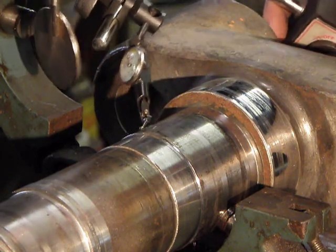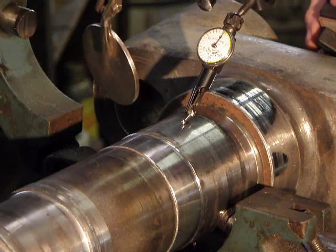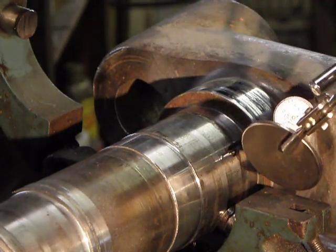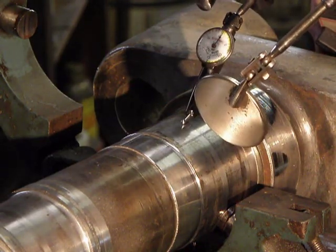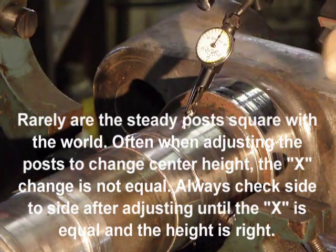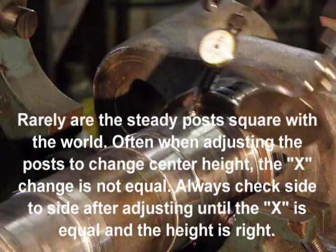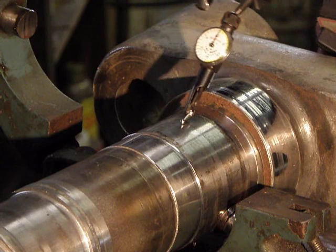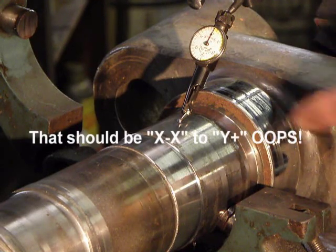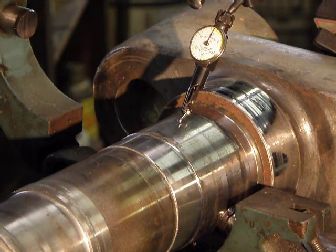About plus one at the top. Minus one. Minus one. Plus one. Minus one. That one's got to drop just a little bit on the back side. See what this looks like — that should be it. Just a little bit plus there, just a little bit minus there, just a little bit minus there. So the indicator is saying it's about a thousandth high from XY to the top of Z, but actually that's really going to come in pretty close to zero, given the weight of what I've got on the rig.